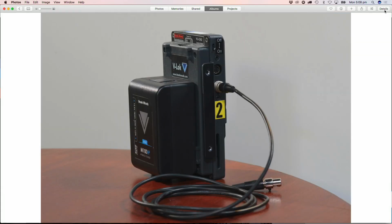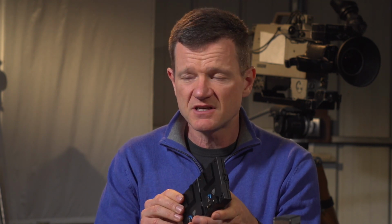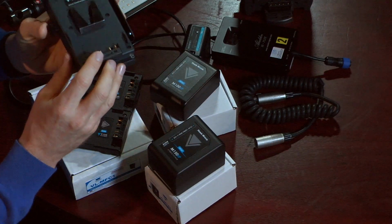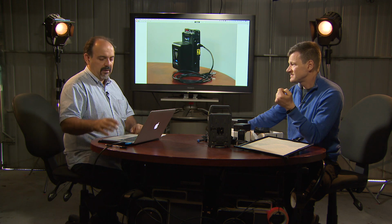Yeah. And what's this plate? Well, look, I just put this in. This is an older Hawk Woods product because this guy has a couple of D-taps out, but it's unregulated, and there's no Hirose. I'm not fussed about that because the F5 has 2 inbuilt Hiroses. The XD Cam has 1. Here's an older Hawk Woods product which is regulated, does have 2 Hirose outputs and an off and on switch. If it's a deal breaker, use that. The sound recordists sort of have their systems anyhow, because mainly the Hiroses are for the wireless mics attached to the back of the camera.